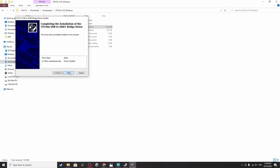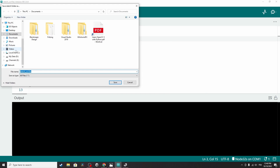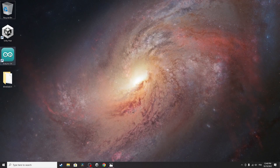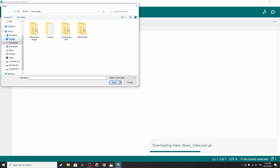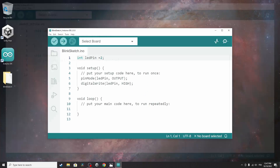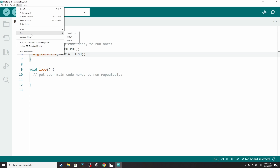Since I have a 64-bit OS, I'll double-click on the 64-bit installer, accept, hit Next and Finish. Now let's restart the Arduino IDE — but first save this file using Save As. I'll put it on the desktop and call it blink_sketch, then hit Save. Close the IDE and open the project again. Go to File, Open, select the blink_sketch folder, select the .ino file — that's how we open and save the project. Now let's select the port again using Tools, Port.